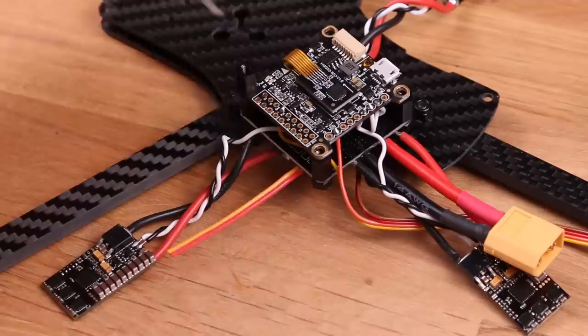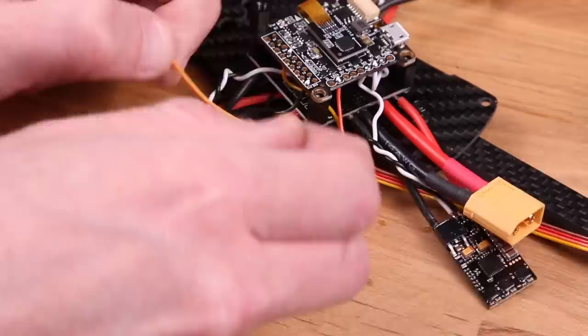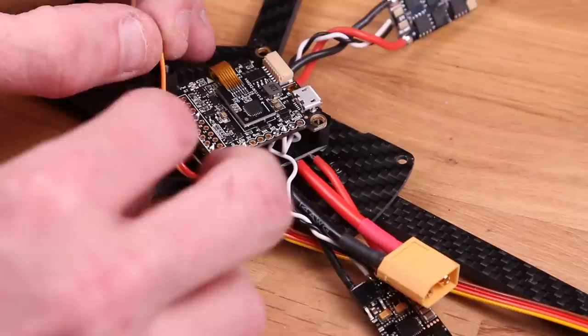If you're having trouble getting really clean solder joints, that might be because you're using too high of a temperature or that you're heating the part for too long. You see, there's a thing in the solder called flux, and that's actually the thing that makes solder flow out and bind to other things. If you're heating it for too long, that's gonna burn off and your solder joint is not gonna be clean and it's not gonna bind well.